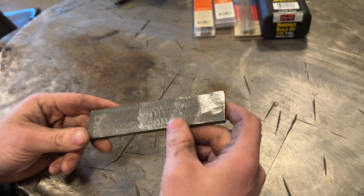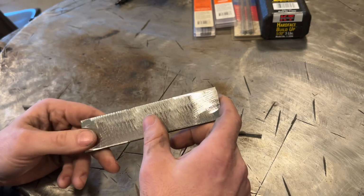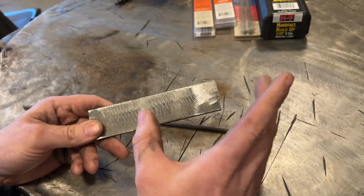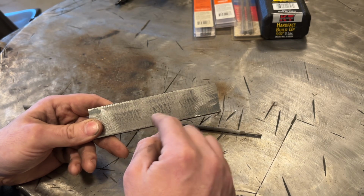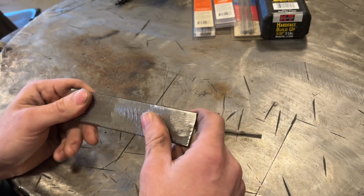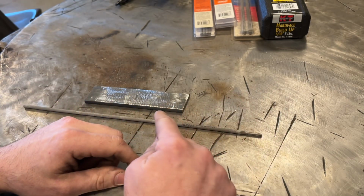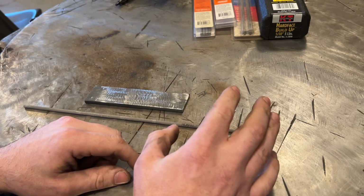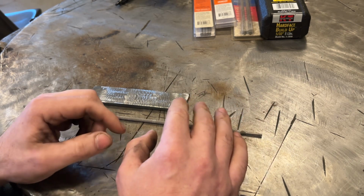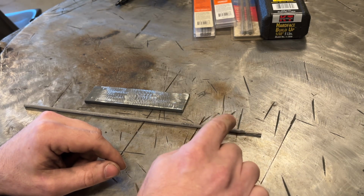So about 1/8 of an inch or so, possibly more. Well, if you run this rod hot and deposit that high alloy weld material halfway through this plate, and then this is exposed to extreme stress, like say something on an excavator or even a plow blade, the probability of brittle failure is very high. So in very simple terms, you want to run this like a bead of caulk on the plate.